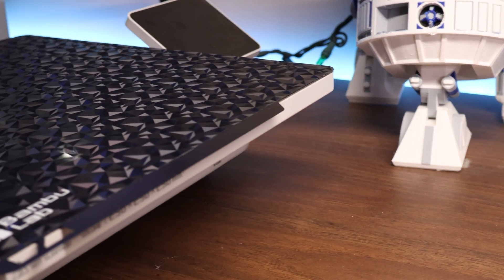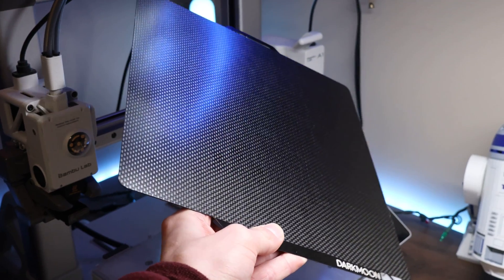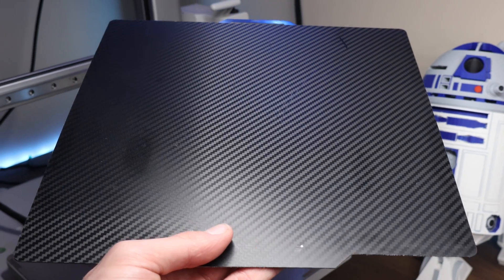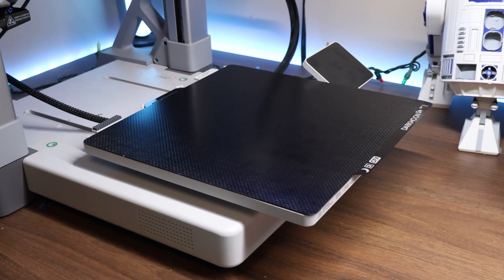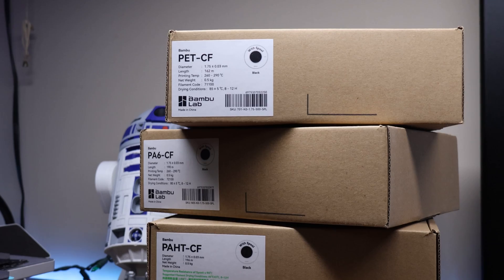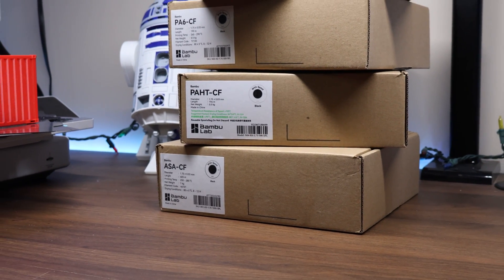But here's something you probably didn't know — carbon fiber can also make one incredible build plate. I'm not talking about the carbon fiber 3D effects sheets that everyone buys off AliExpress. This is the Darkmoon 3D CFX build plate, and this is not sponsored by them. Unlike the aesthetically focused PEO and PEY 3D effects sheets that just look like carbon fiber, the CFX plate is made from real woven carbon fiber, infused with a high-temperature resin and mounted on a black oxide spring steel sheet. This build plate is not just about looks — it's designed for performance, specifically with high-temperature engineering-grade filaments.